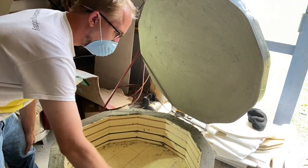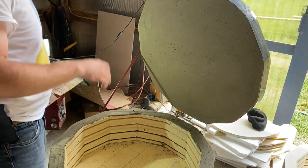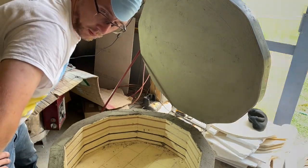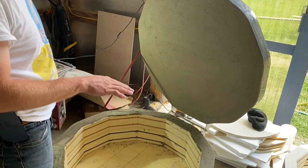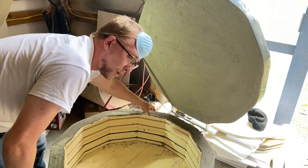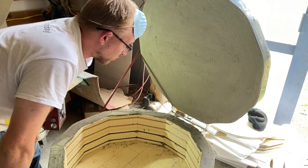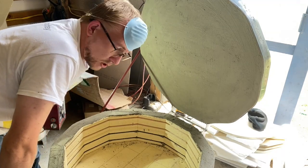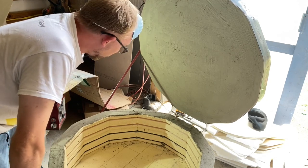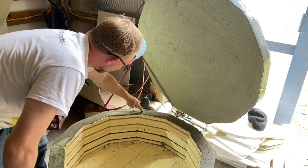I also applied a whole ring of mortar on the outside ring. One of the reasons I chose to apply it to the refractory brick — which is not normally done — is because I was losing heat. The refractory brick was pitted, a lot of material was missing, and it was very fragile. I wanted to secure that brick in place and make sure I didn't have any more cracks developing.